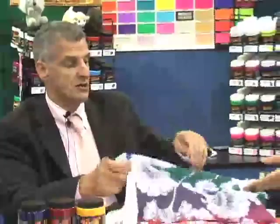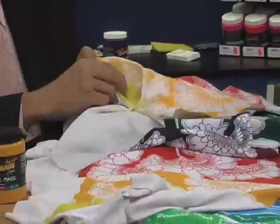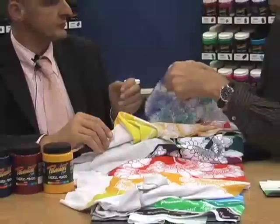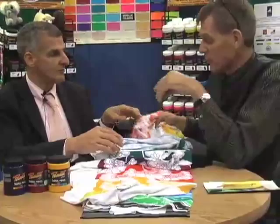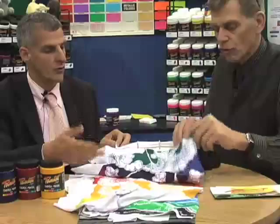This is a stretch fabric for swimwear — tough fabric — no stretch additives, no synthetic additives, and the product works right out of the jar. At a practical level that confers a lot of advantages for a print shop, because historically the first printer would add a synthetic additive, put the leftover ink back in the jar, and the next guy would add a stretch additive — so you'd end up with two additives polluting the stock. With this product all the quality is built in: the stretch, the adhesion — and it feels like something you'd want to wear.